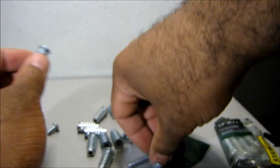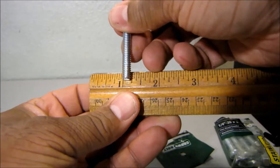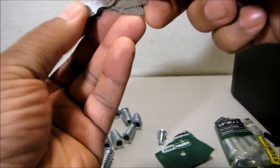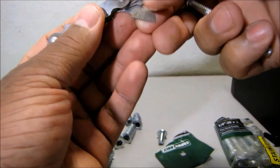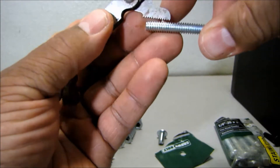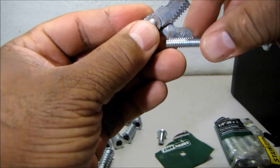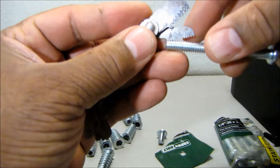These are quarter inch — and just to measure the bolt again, as you can see that's a quarter-inch bolt right there. Also, to make sure, I have this thread gauge which measures the pitch of the threads on the screw. This one is 20 — it's actually a 20-thread-per-inch screw. And as you can see this gauge fits — the teeth on the thread gauge line up with the threads perfectly.